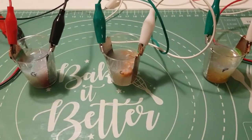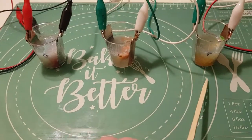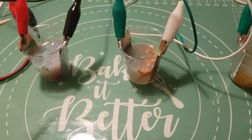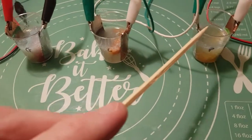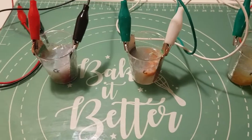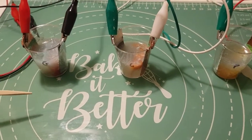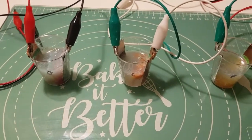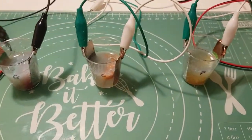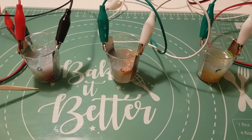I've finished running the tests on the three cells. We have the glucomannan here, the wallpaper paste carboxymethyl cellulose in the middle, and the potassium polyacrylate on the right. In each of these we have 15 grams of the mixtures with about 0.9 grams of sea salt — sodium chloride. The tests were charge cycles at 1.8 volts for 10 minutes, then a discharge on the data logger at 10 milliamps down to 0.3 volts. I ran each of these cycles about five times.